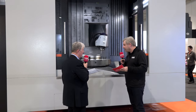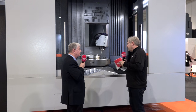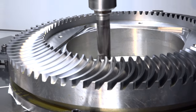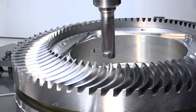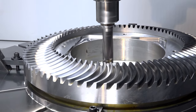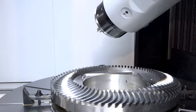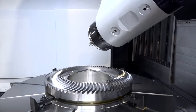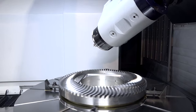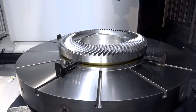You're milling, turning, and grinding — does that not give other issues in terms of swarf management? With milling and turning you get chips, and grinding has different debris. You're absolutely right, but on this particular machine the guarding is designed to suit turning, milling, and importantly grinding as well — so grinding dust is also covered by the standard guarding.